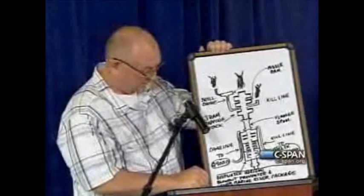At the bottom you have the blowout preventer and the lower marine riser package that are left over from the Deepwater Horizon loss. That's right down here. We are currently producing off the kill and choke lines of the lower marine riser package and the blowout preventer — through the kill line to the Helix producer and the choke line to the Q4000.